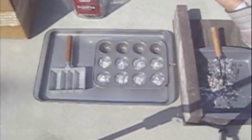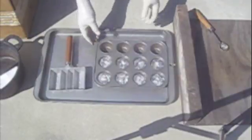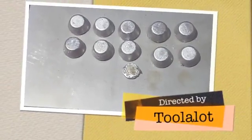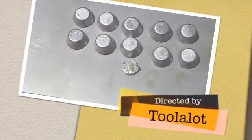There you have it. So what you've got now is your mother lode. Each ingot here is about 280 grams, it varies a little bit. Each of the 53 caliber lead balls — approximately a half inch in diameter — those are about 14.2 grams. So each one of these ingots produces about 19 of the lead balls. We have approximately 200 lead balls right here for just our one morning's work.